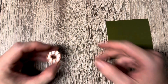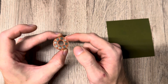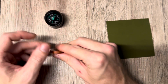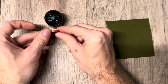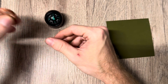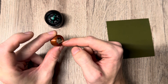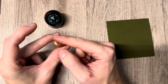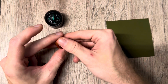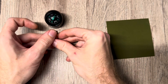I'll also show you some simpler arrays. This one is easier to build and is the same concept — it has eight 5mm cube magnets with the same poles facing toward the center. In this case all the north poles face to the center, so north pole on here, also north pole on this side, and all the south poles are on the outside. Even simpler is this array where I took four 10mm disc magnets arranged in a circular pattern, all facing the center with the same polarity — south pole on here, south pole on here, and north pole on the outside.